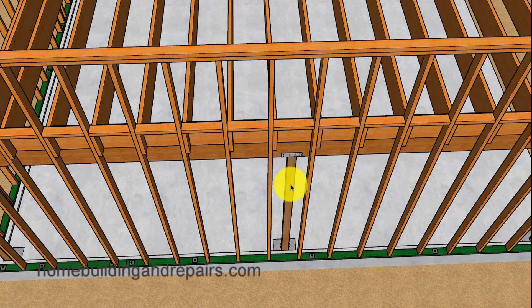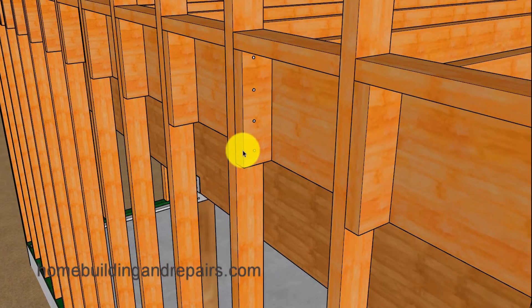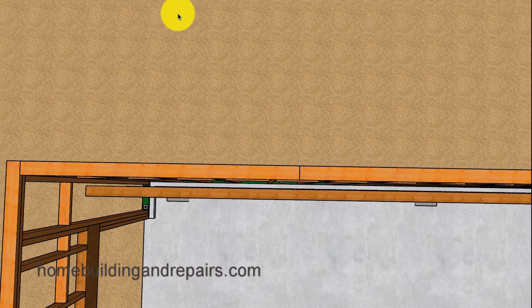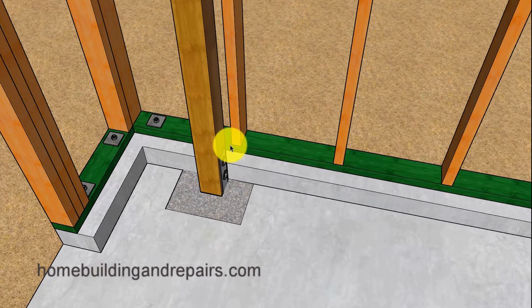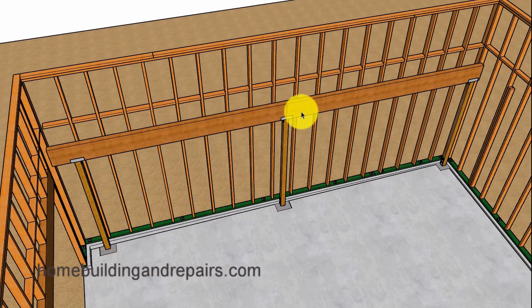We have all of the blocking, and if we use a center post — especially for those who have problems finding larger lumber or need to use smaller beams — you could break the beam to where you have a 12-foot beam on one side and a 12-foot beam on the other side. Keep that in mind when designing your project. Let's remove the floor joist and take a look at the space between the beam and the wall. That space is going to be the distance between the curb and the wall framing. Even though you can bring the post closer, the beam can usually cantilever this distance without a problem. Try to leave a gap of about a quarter of an inch between the wood framing and the concrete.